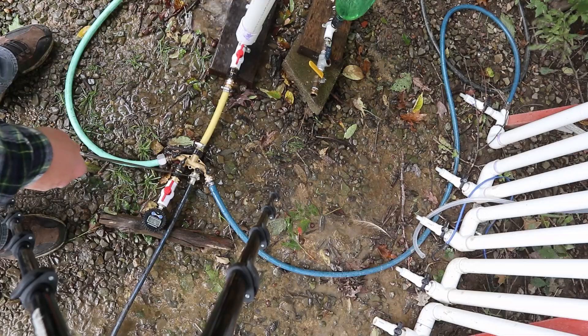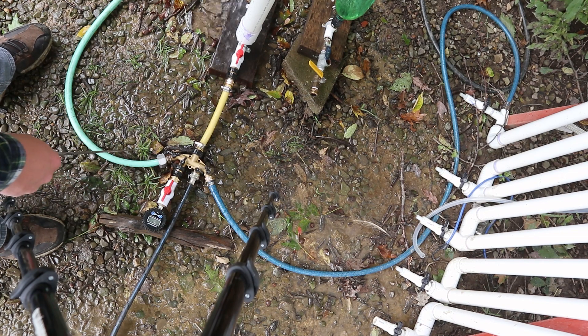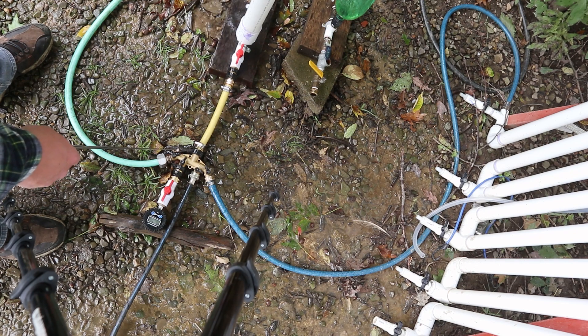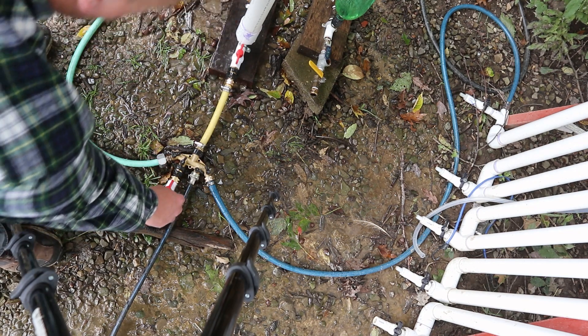The output here is at the same effective elevation as the other green hose that I have way up the hill. Let's go check it out. For this demonstration, both the artificial back pressure and the traditional delivery pipe are open. They're both flowing about the same amount of water, so I know that the effective delivery height is the same for them. Let's turn off the artificial one.